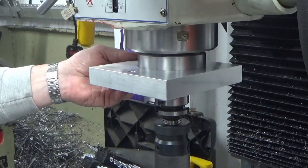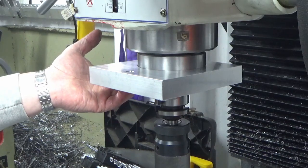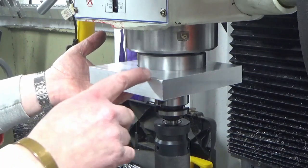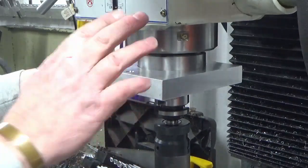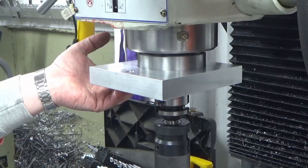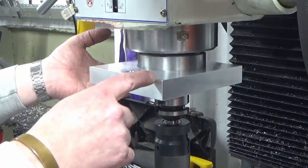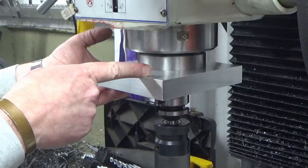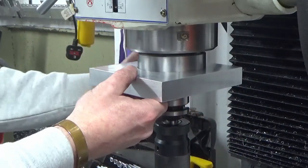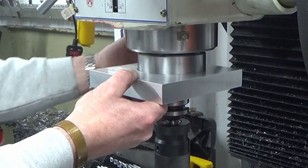Okay, so that's got the basis of our quill plate done. So the next job now is I'm going to blue one face up. I'm going to do quite a bit of marking out. I'll do most of that off camera, it's just measuring, scribing. And then I'll bring you back when we're setting back up on the mill to do some of the material wastage on the corners, the slotting and the drilling for the clamp bolt at the back.